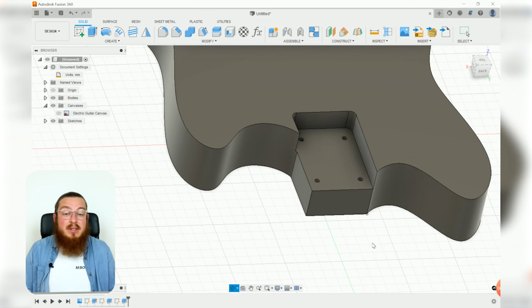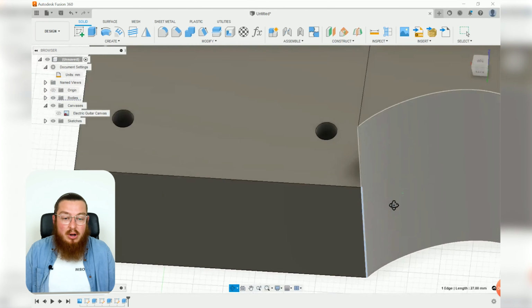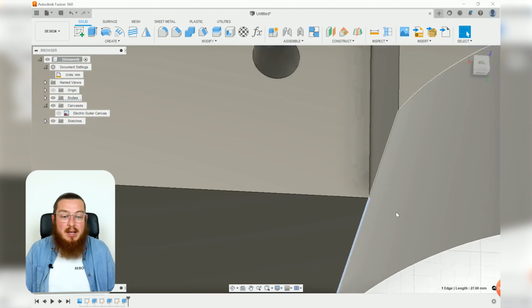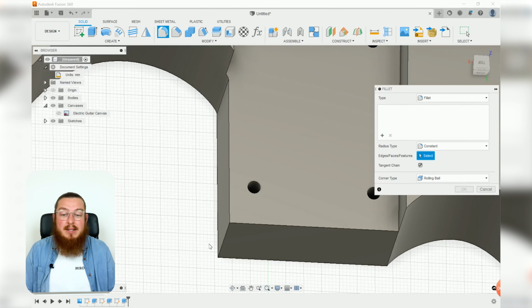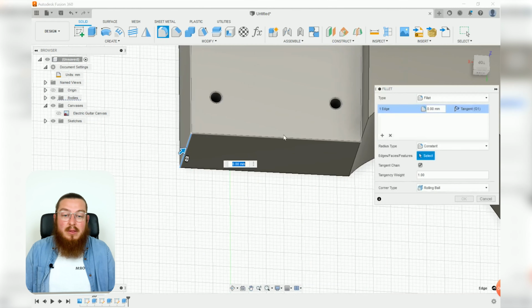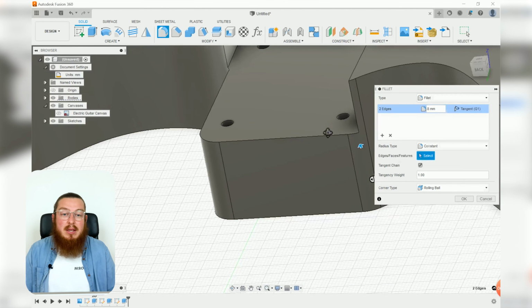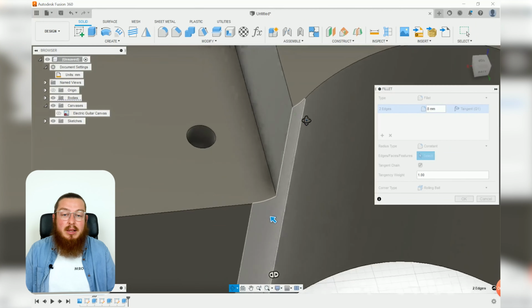You'll notice that on this guitar body, we do have some kind of sharp corners there and there. In fact, this corner may not line up exactly perfectly with this top line. If that's the issue, no worries. We can always add in a nice big fillet just to knock that down. So I'm going to be clicking on these 2 bottom lines and adding in an 8mm radius, and this will kind of knock off that sharp point just a little bit.